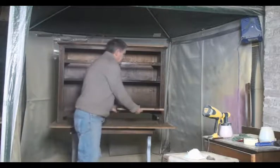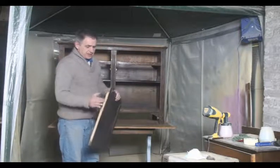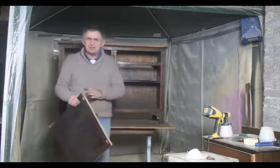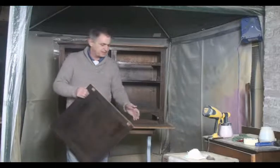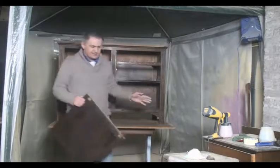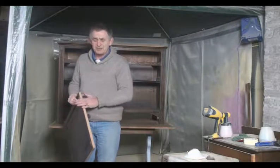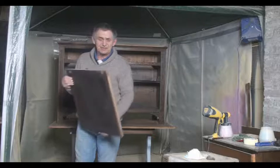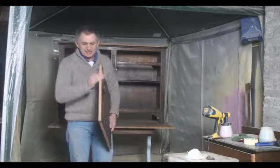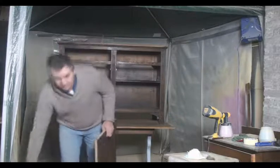A good point to always watch for if you're doing this for yourself is that doors basically have just a few coats of varnish and it's very thin, so when we want to put what's going to be four coats of paint on it and two more coats of varnish, we're actually adding a lot of thickness to this door, making it bigger. So when we sand it back, we actually take a good bit off. Alright, now then, we're ready to go painting.